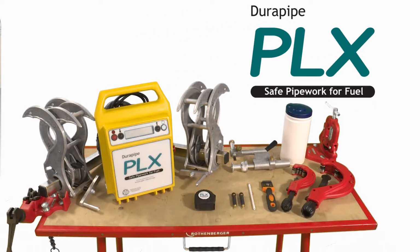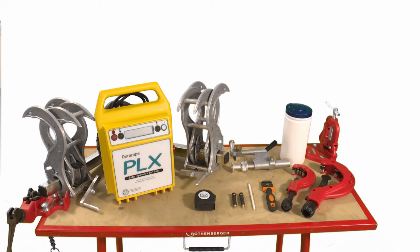The equipment you'll need to perform reproducible jointing of the Durapipe PLX Pipe-in-Pipe secondary containment system includes a Durapipe PLX wheel cutter, a PLX preparation tool, a hand scraper, a Durapipe PLX universal clamp, wax pencil, Durapipe isopropanol wipes, a Durapipe PLX electrofusion control unit, and measuring tape.